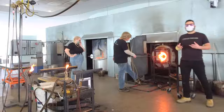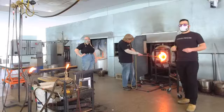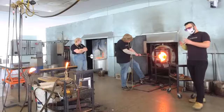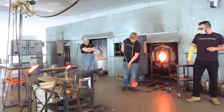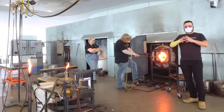He's trying to really expand out that neck, which is the first area connected into the punty — that's connected to the blowpipe. In glassblowing jargon, that area — the neck and shoulder — once we flip it, it will turn into the lip. Still doing very targeted heats because at this temperature, if he gets it too high, that bubble will start condensing on itself, throwing the weight off, causing the turning inside of the reheating chamber to become very difficult. Once again, using gravity as his blade — and you can see how we went from that squat shape to now this elongated, almost teardrop shape. Just really trying to balance out that glass and pull from that middle, trying to make it look as nice and smooth as possible.